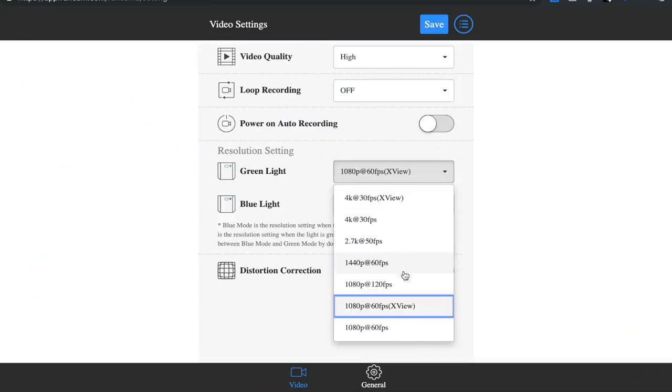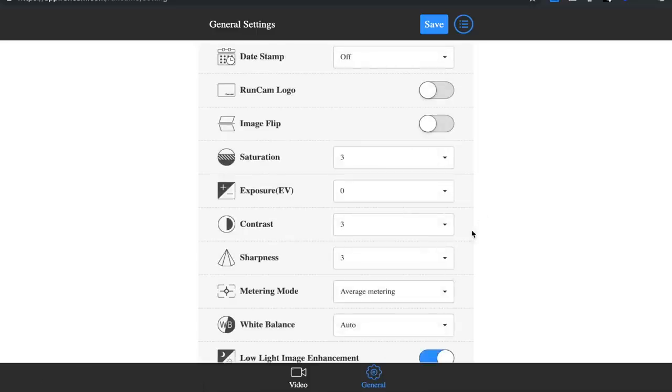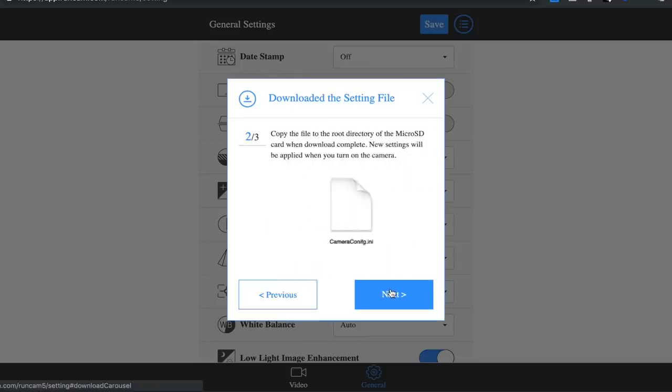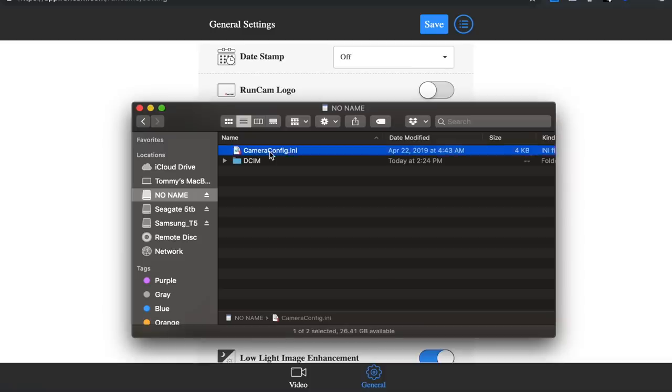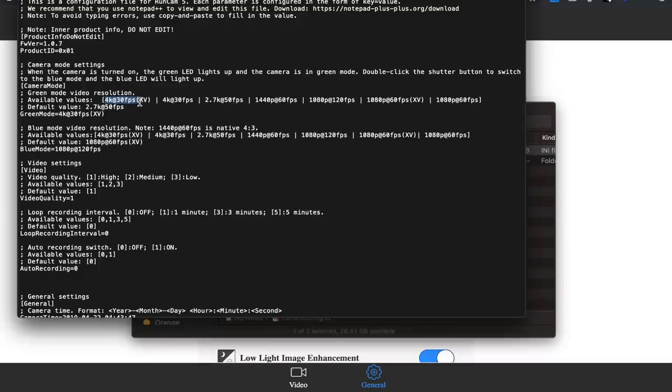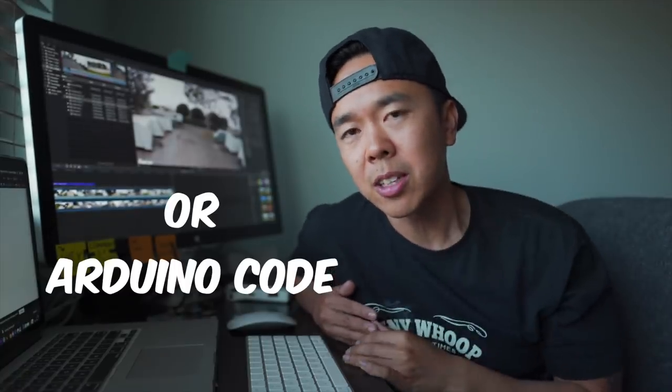For $99 set to 4K, this is doable. Now this doesn't come without quirks — it's only got one button and you can change between two modes that you set. There's no Wi-Fi, and the only way to change settings is to connect to a laptop and use RunCam's online app, which generates a config file on the SD card, or you take the SD card out and open the file manually in a text editor like Notepad and change things as if it were a command line — similar to the CLI in Betaflight.